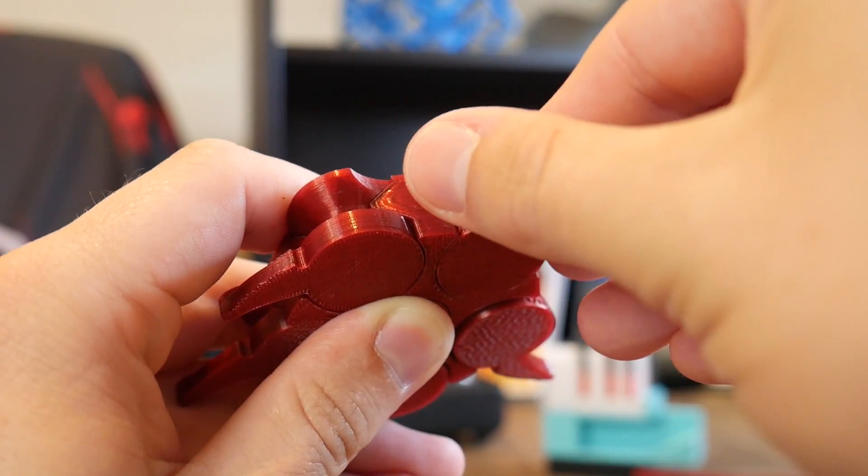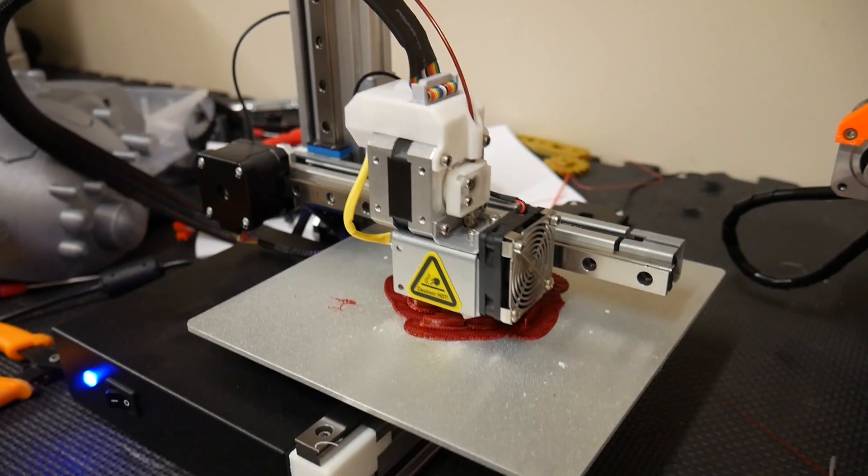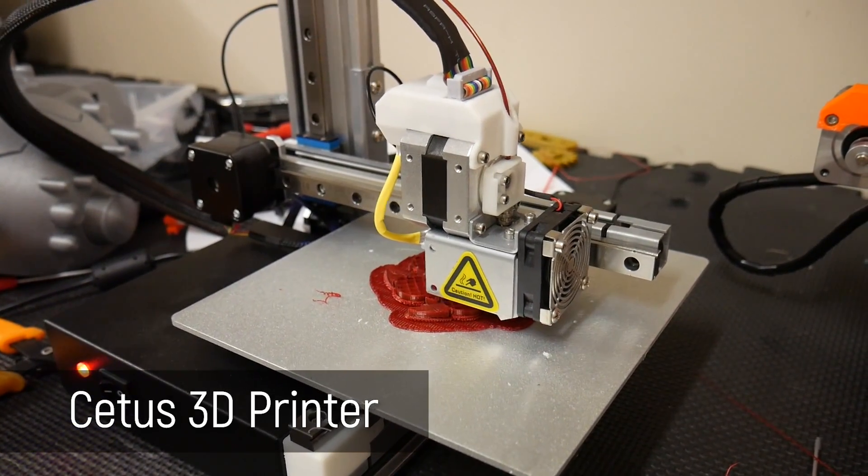This file is designed to be tool-less. It has these little claws on the side and as you open them up it reveals 'unlocked,' proving that you've achieved those tolerances — all the way from 0.5 down to 0.15 if you're lucky enough. Now if parts are stuck — for example here I have one printed on the Cetus 3D and the 0.15 looks like it could be free but it's stuck — you can grab a flathead screwdriver, pop it in under that claw, and lever it. If it doesn't break the tab off you should be able to free it up.